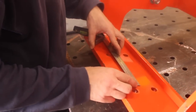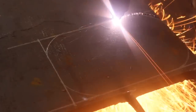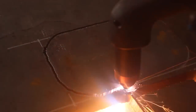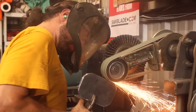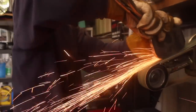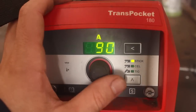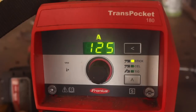Let's see what size we want to make this. We're going to be welding this in place with the help of some 1/8-inch 7018 stick electrodes, which I've chosen for the ductile welds they produce and the fact that they tend to resist shock loading and vibration a lot better than several other types of welding out there.